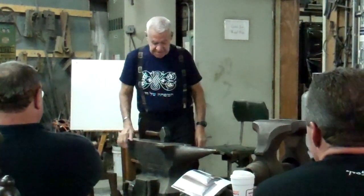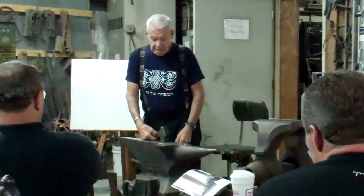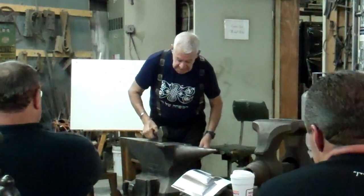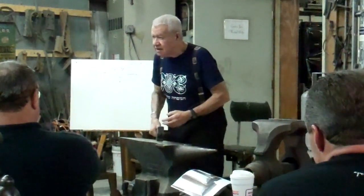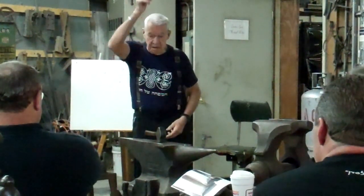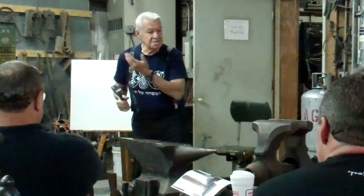Yeah, okay, enough. So we are standing like this, and there is another thing that I saw very much in England and also in the States. You see many people that are bent like this, and they look on the work from this side. And then, what happens when you bend? You see, you can raise the hammer until here. You cannot go more. This is the highest place. You cannot go reverse because the bones don't let you go.